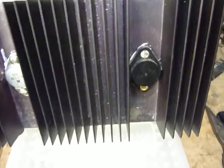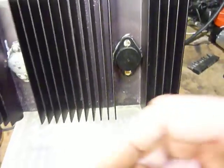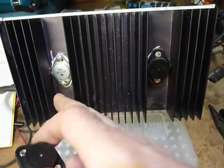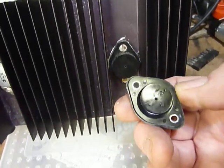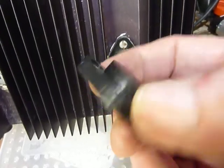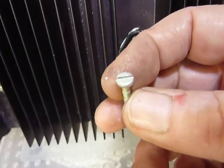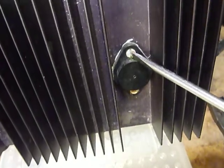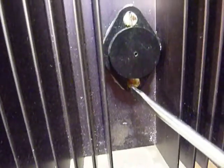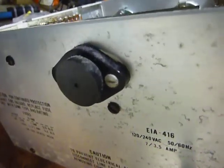I have used it here for a while and decided to do some more checking on it. The thing I ran into was that these little caps that go over the power transistors make a connection to the collector of that transistor through those little aluminum bushings and also through these zinc-plated 6-32 screws. As you can see right here, these things tend to corrode — you can see the corrosion quite plainly on that one.